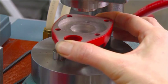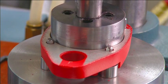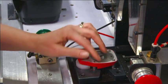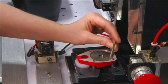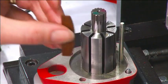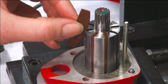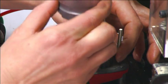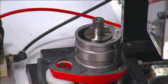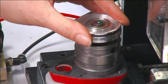To assemble the motor, they start with the back cap and press in a bearing on which the rotor will spin. Next, a plate to enclose one end of the rotor and an alignment pin to position the plate for enclosing the other end, and finally the rotor itself. Into each of the rotor's slots goes a vane made of resin-imbued fabric. These vanes work like the blades on a windmill — the air entering the tool turns them, which spins the rotor. After slipping a steel cylinder over the rotor, they enclose it with a second plate, then a larger plate with a ball bearing.